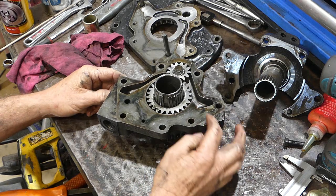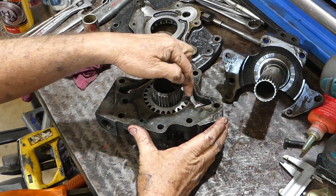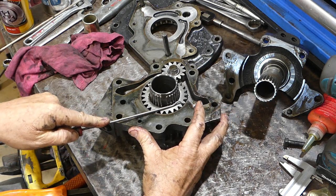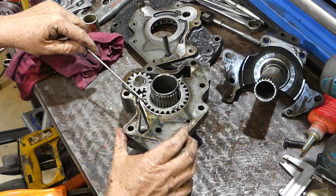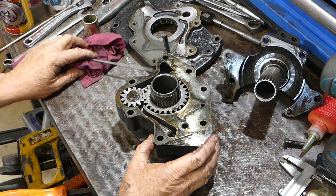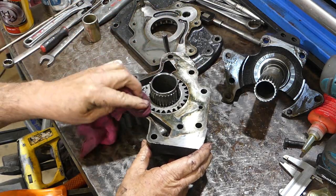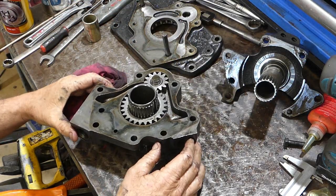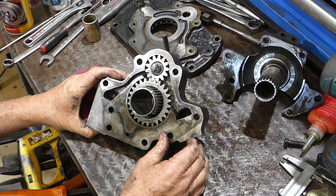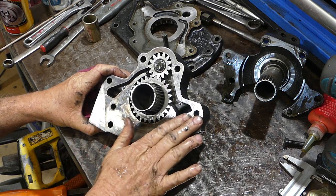This is the big inlet here. So that's the big one — we know this is inlet, this is the oil coming in. So this pump would turn this way. The oil doesn't squeeze through the gears — the oil comes around the outside of both of these, then into the high pressure port just here. The oil will be trapped between the teeth in this little cavity, then it comes right the way around and is released here. We have two lots of oil coming in — so that gives us our transmission pressure. This is just a low pressure pump. I think the 2030, 2130 and all that — the transmission pressure is only around 120 psi or so.